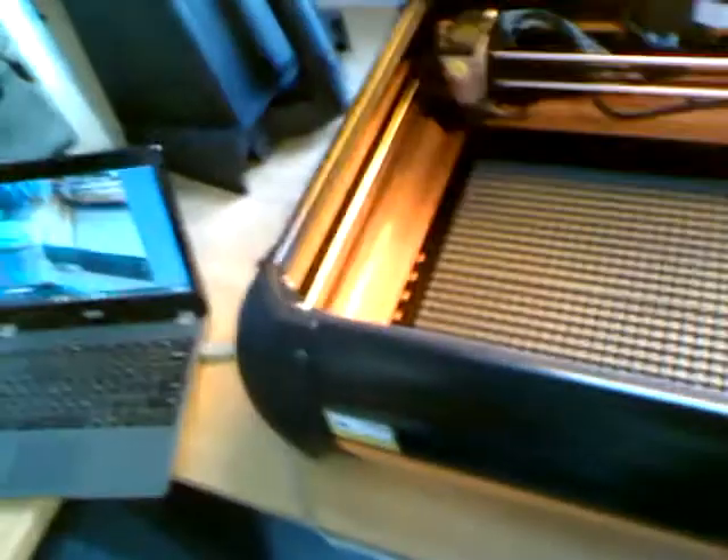And lastly, there's a camera in the back of the laser engraver, which will allow you to check out what's going on on the inside. I was telling you about the safety protocols — safety kill switches that they have whenever you open the lid. Here you're going to see some metal tabs, probably copper coated. And on the lid, you're going to have two metal plates which would connect to those copper tips and complete the circuit, allowing it to turn on.